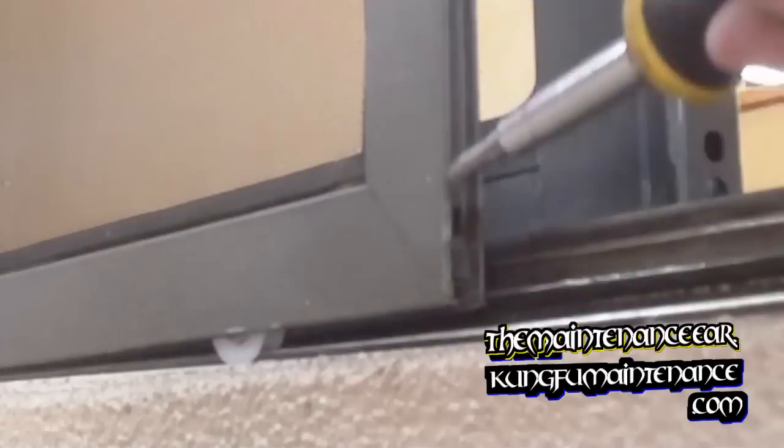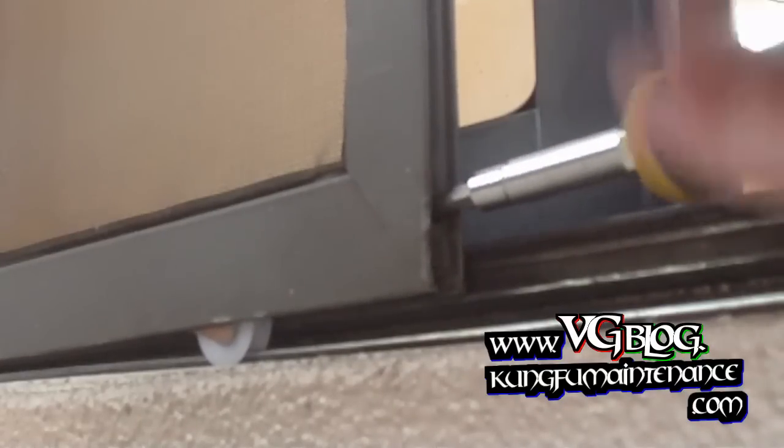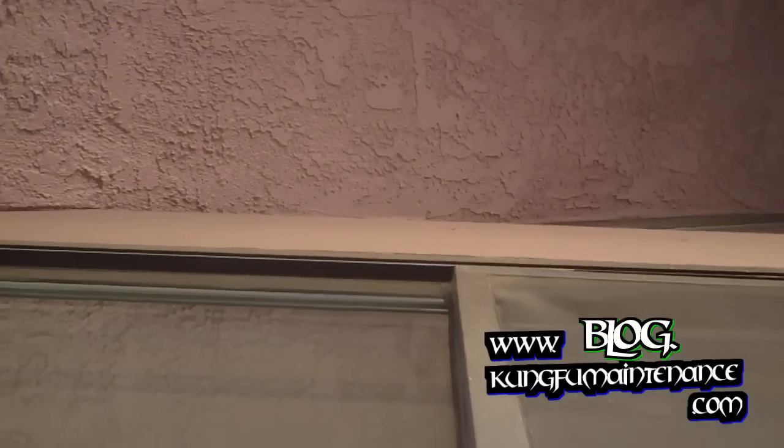Same with the foot wheel. Now we can adjust our tension as well as the pivot, like the screen door and stuff. We also have adjustments on the top to put it down a little bit if we need to, depending on how we're lining up. That's pretty good there — nice and even across the whole way of the door. Loosen this just a hair, and some silicone spray won't hurt either. The door is hanging up a little bit on the top, so I'm going to lift this side up also. I'm adjusting the pivot screw here.